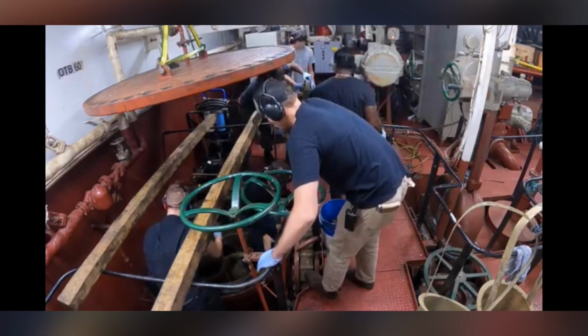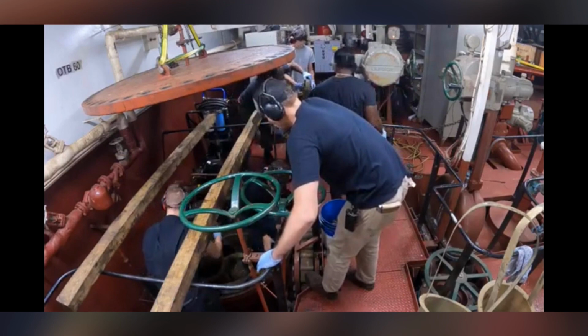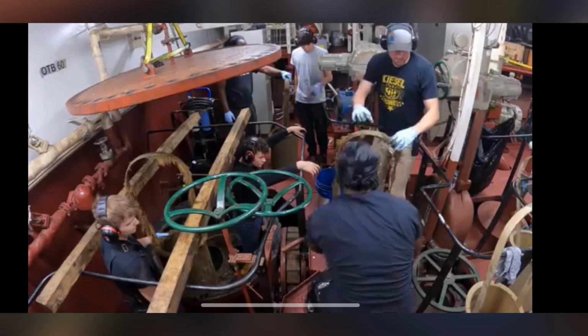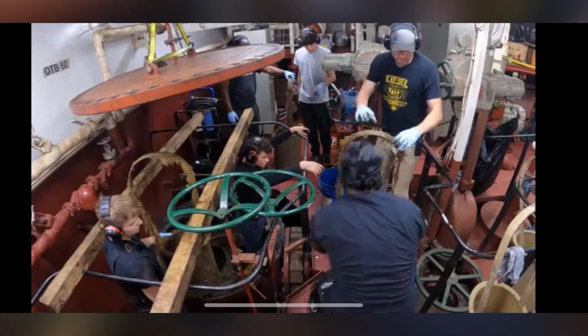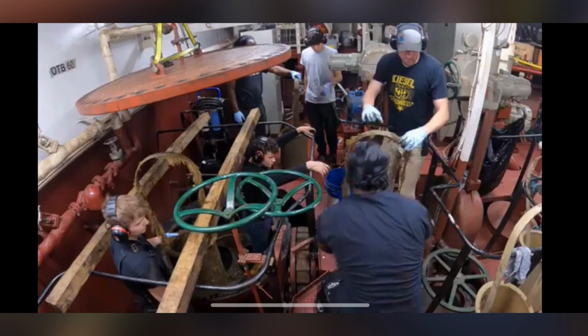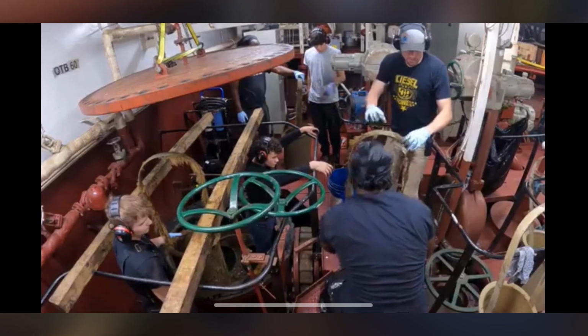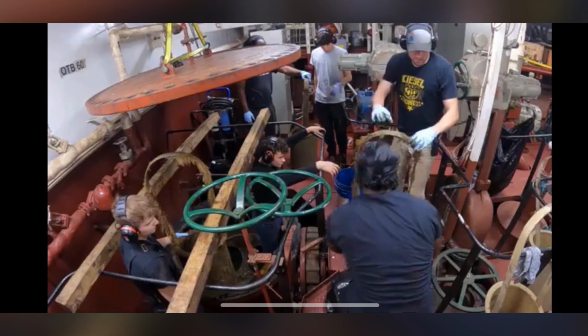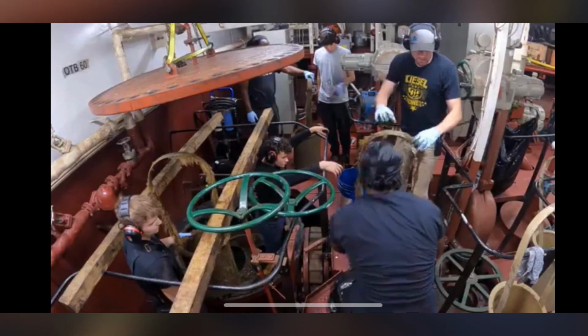That is me and Midshipman Rampton removing the dirty baskets. There are 4 strainer baskets in each of these sea strainers. Instead of cleaning them, we had 4 clean ones on standby, but we did clean these afterwards with wire brushes and hot water and disposed of all the contents properly.